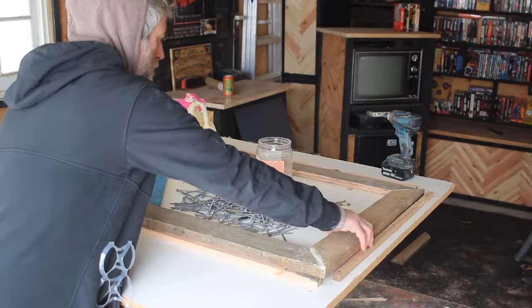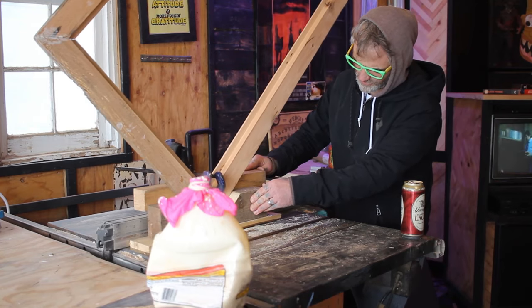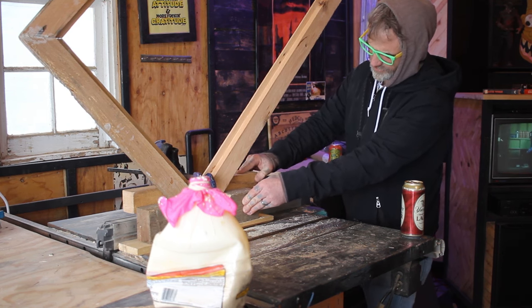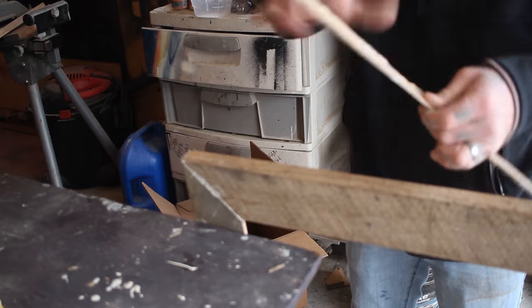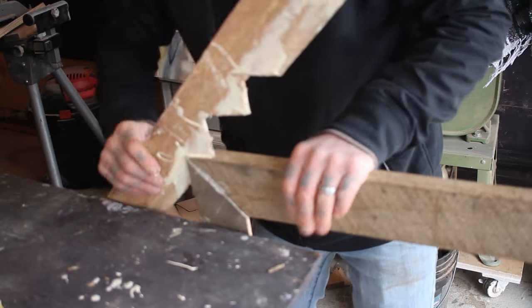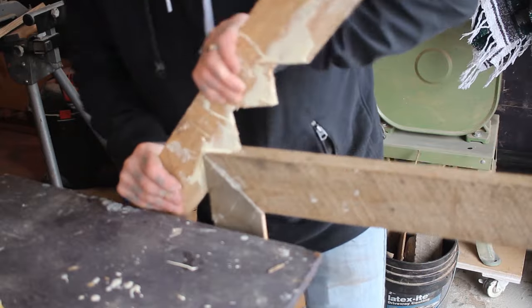The next day I came out, removed the wedges, and took the frame over to my table saw where I used a handy little jig I made to cut eighth-inch slots into the corners of the frame. I'll be sliding eighth-inch boards covered with glue into those slots to help secure the frame and make sure it's nice and sturdy and never falls apart. I made a short video about how I made this jig — the link is down below in the description.